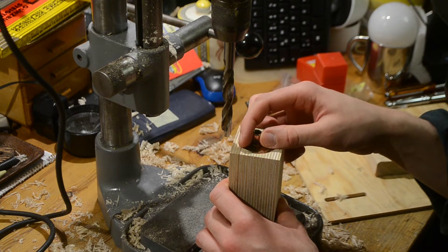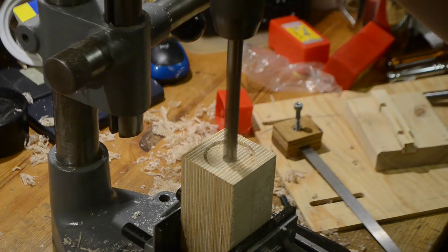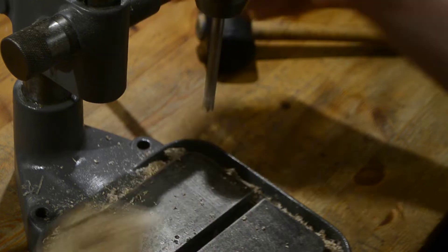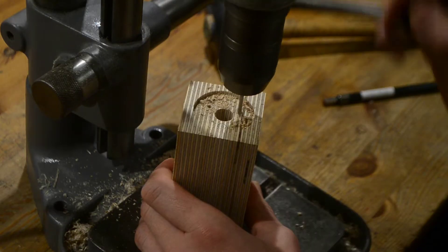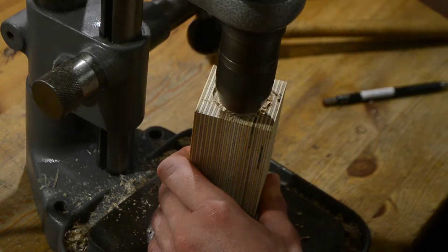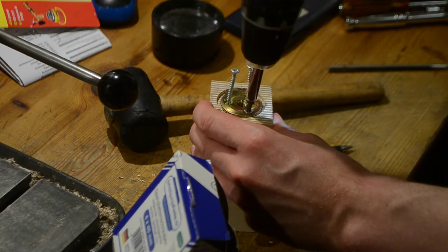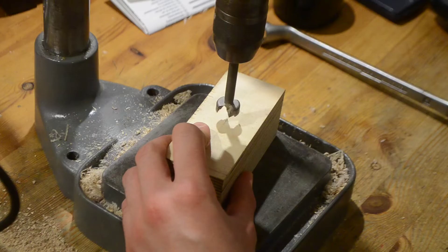I always tried to use stuff that was laying around, so I used three sheets of fine birch plywood glued together. For the final build I would use one solid piece of thick hardwood. Here you can watch me drilling the various holes of the transport block. The first holes are to fit the flange nuts on the sides — for no interference I actually drilled deeper than the full flange nut so the bolt has enough room.